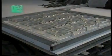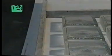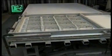Four metal or wooden bars are fixed around the perimeter, in this case using simple vices. These serve to determine the width of the outside edge and to hold the concrete casting. The outline of the finished panel has now been determined.